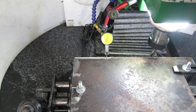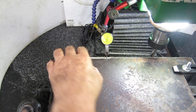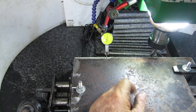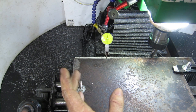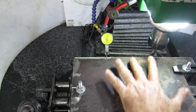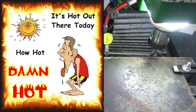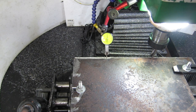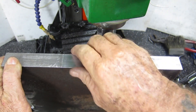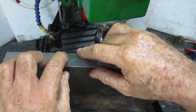Not exactly the flattest of surfaces - I can never get a decent side mill cut going in Y. We knocked all that off this morning. The surface isn't particularly smooth either. I kept thinking will I have room for a clamp up here, and the answer is no. So while I still had it all set up that way this morning, I milled a slot in here so I could use that slot to bolt it down. And viewers - I stuffed up. I forgot to lock the Z axis, which made it fall forward a little bit, so I've got a bit more of a step there.